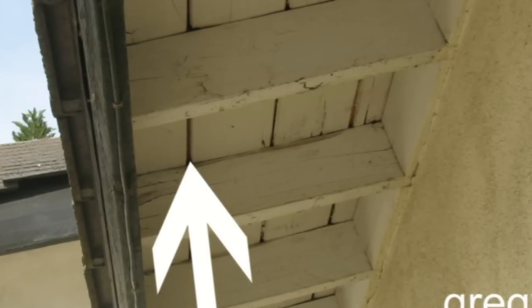Two things you need to remember: make sure that you paint the edges of the board, which is what I did not do here. And the other thing is, do not assume that the wood is going to be dry enough to where it will not shrink. Do not let this happen to you guys. And don't forget to watch more of our videos for more interesting tips and ideas.